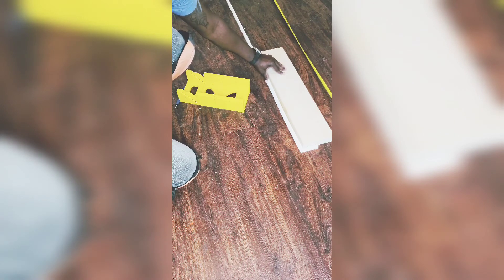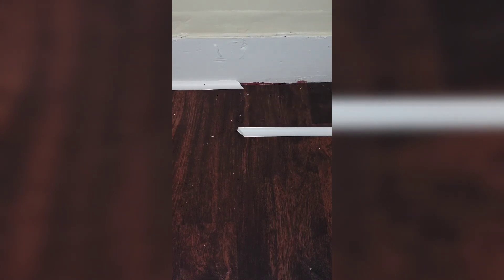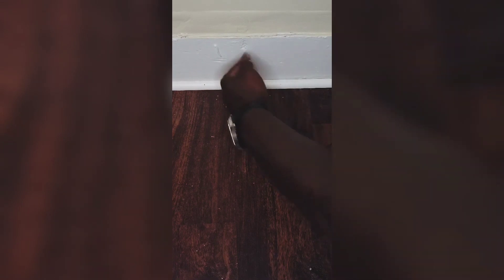Hopefully this won't confuse you, but I think it's fairly easy. Once you do it once or twice, you can get the hang of it. Another quick tip: if you have a situation where it's not a corner but you just run out of shoe mold or whatever molding you have, just don't butt the two pieces up together at a 90 — flat surfaces to each other — because the gap will be more than you'd like. Instead, angle it and butt them together; that will make it look better once you put your caulk in. So you can put some caulk in there. Quick tip: don't put them flat like that — put them at an angle like that. It turns out a whole lot better.